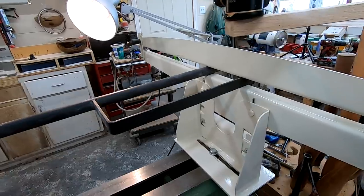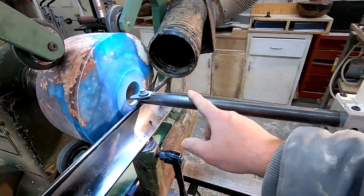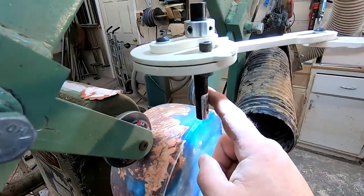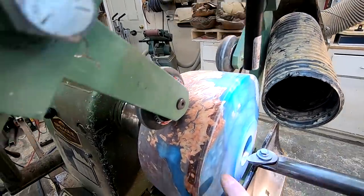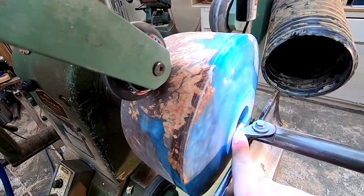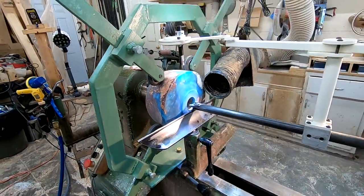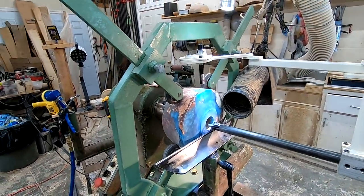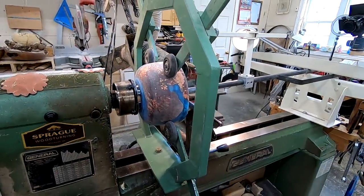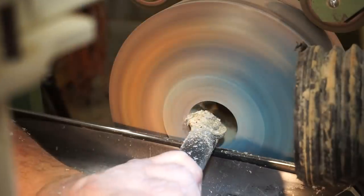For those of you who are new to the channel, this is my one-way hollowing system - it's a captive system. Right now I've got the straight boring bar in there with a teardrop cutter. There is a laser right here and you'll be able to see it drop off on the side of the urn once we reach the wall thickness. I've got it set at three-quarters of an inch right now - I'll change that as we go. I've also got this big beautiful steady rest that my son made for me.